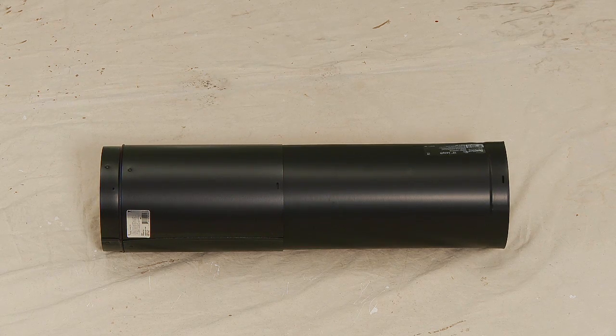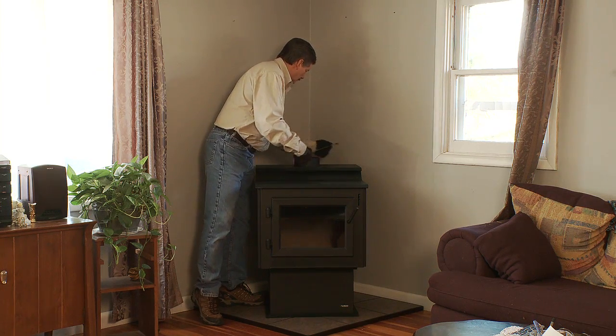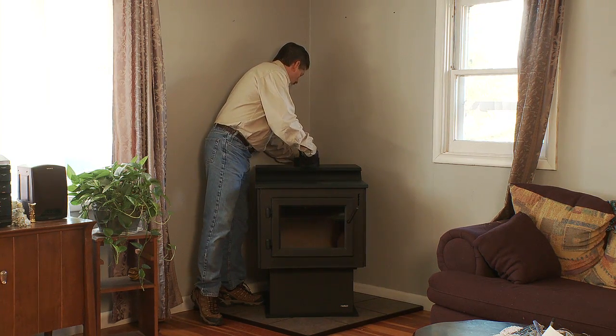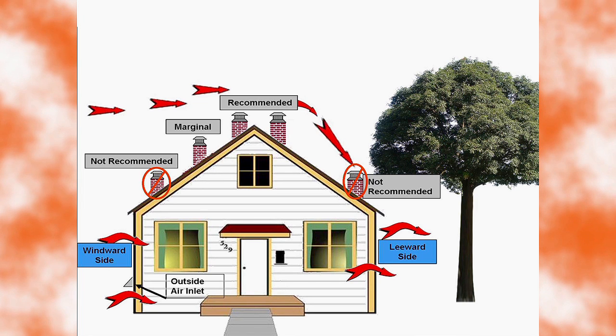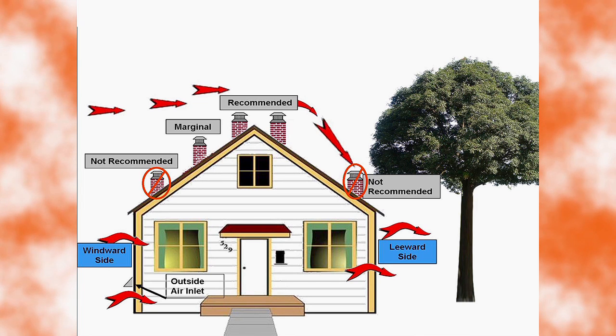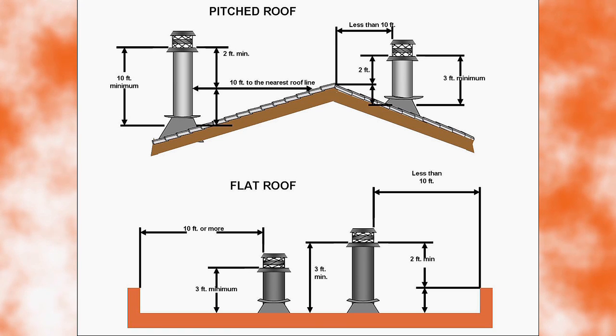The unit will need to be exhausted through a chimney connector, flue pipe, or stove pipe that is approved for wood burning products. You will need to maintain the clearances and safety rules determined by the venting manufacturer. On the outside of the home, you need to consider the termination of the flue system to ensure that the unit performs well. Wind direction, the outside construction of the chimney connector, and the required minimum and maximum length of the venting are all factors in how your stove will operate.